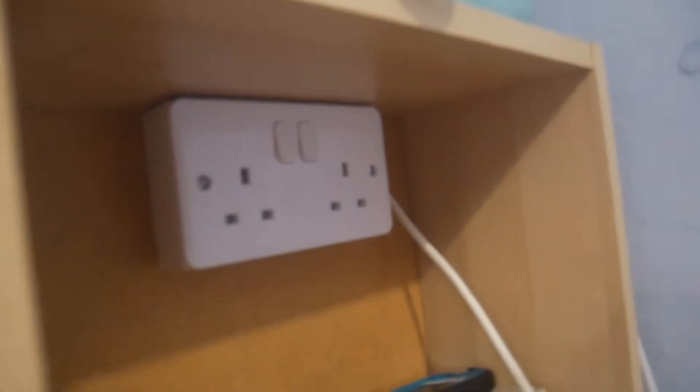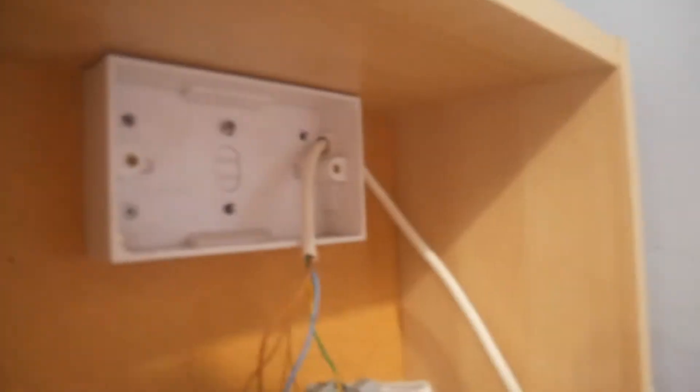At this point, we have our single plug here. We have our three pieces of wire — green, blue, and brown. Here's the socket that I'm hacking into to get power from. This is the one that I'll be piggybacking power off. So here I am behind the socket. This one is made by Schneider Electric, but it will work with any socket. You have your three ports: earth, neutral, live. It's quite straightforward — you have to match these colours up to the same terminals. Blue for neutral, brown for live, and green and yellow for earth. However, there's a patch of spots here, and if you were to do that it wouldn't close properly, so there's a step you need to undertake. Down the side here you have break-out tabs, which are designed for breaking out new sockets. But if you want to expand any wire, the way I tend to go in is simply with a hammer — gently.